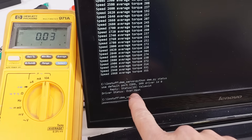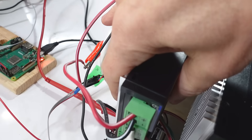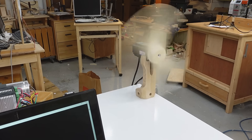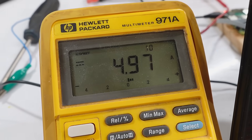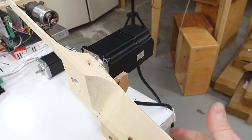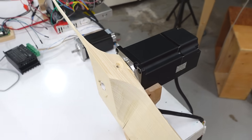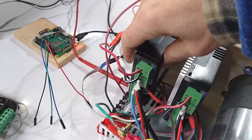At 2960 RPM it wasn't even using its full torque, but checking the status it said overheated. The motor itself is only warm, and the controller just warm — not hot. Trying again with a faster ramp, this time we got to 3060 RPM, and actually my program terminated the test because it was hitting maximum torque. The current got up to 7 amperes at 48 volts, pretty much the rated load of the power supply. With a fan blade, power usage goes up with speed cubed, so going from 1750 to 3000 RPM the power requirement goes up five-fold — it's doing well. But it can only do that for short sprints before the overheat warning hits, and I think that warning is quite conservative given the motor and controller are only getting warm.